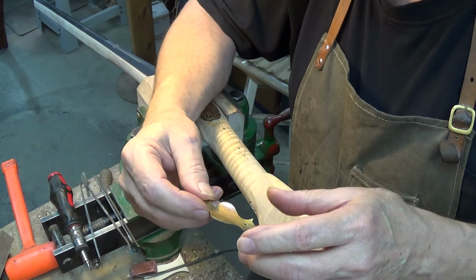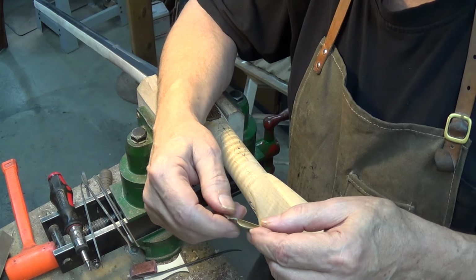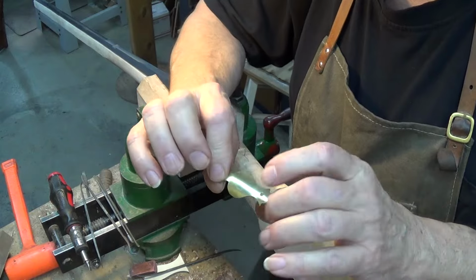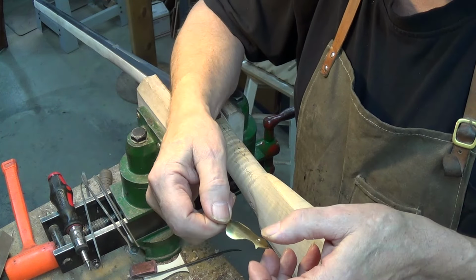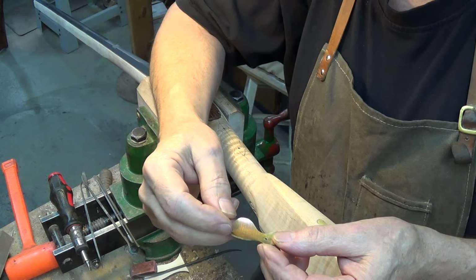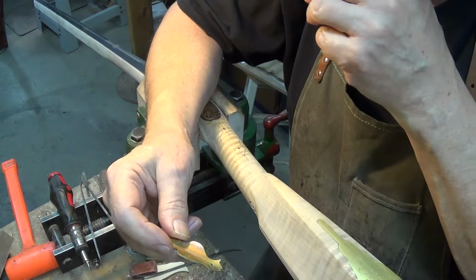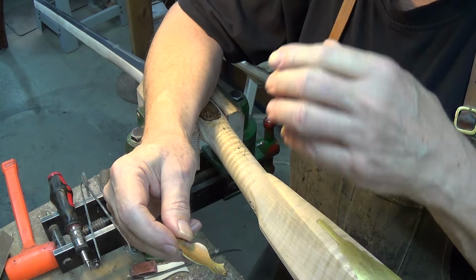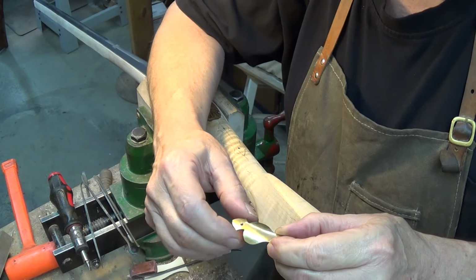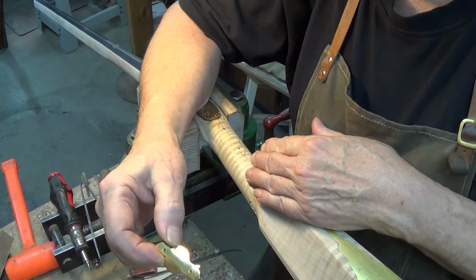And there's a number of things you can use. A piece of pipe, you can hammer down over top of the pipe, clamping the ends if you want to as you go along. I've got a swage block for my anvil that has different radiuses on it, so I use that. But basically you just want to pre-form it. You'll do more forming of it after you get it put on the wood preliminarily.